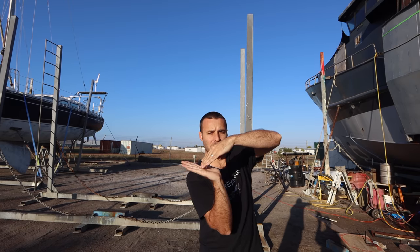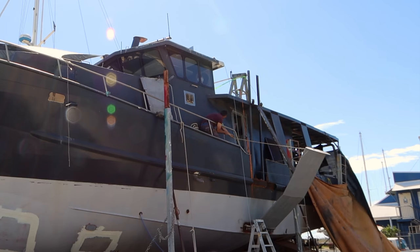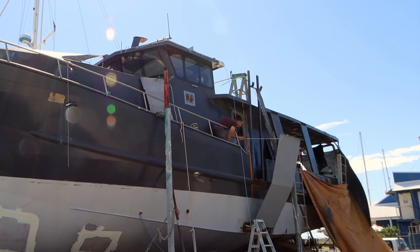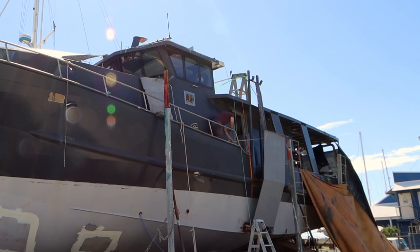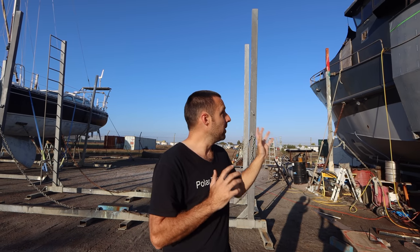So as the wing comes up, the cable is pulling it 90 degrees to the surface. So it's pulling it into the boat rather than trying to lift it up. And that's exactly what happens if you're lifting from the top of the arm. You're trying to pull the wing vertical rather than pulling it into the boat. So it's way safer doing it the way we're doing it. If we did it from the top of the arm, when the wing's sort of 80 to 90% closed, they'd end up flopping like that, and there's no way you'd be able to stop that, so it's incredibly dangerous.